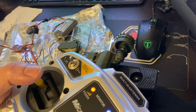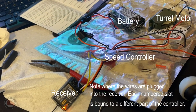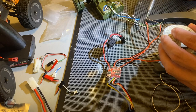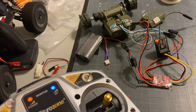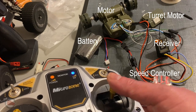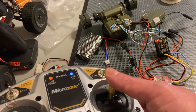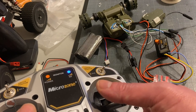Here I'm using the turret motor — you can see it spinning, and it's nice that you can change the speed. I also wired up a little power switch between the battery and the speed controller, just making it easier to turn the power on and off. I was pretty excited — the test went well. So it was time to solder all those connections together. They were just twisted together so I could easily change things up if something didn't work. I wrapped those up with electrical tape, and then I'm doing a test to make sure I didn't mess anything up when I did the soldering. You can see the one stick is linked to the motors — the speed controller's interpreting those movements of the stick to give power to one wheel or the other, or run one motor or the other. Really good — the guts of it work.